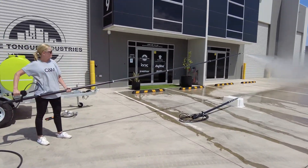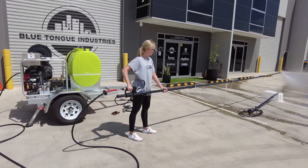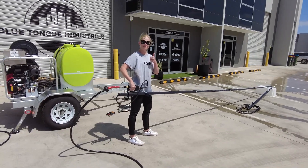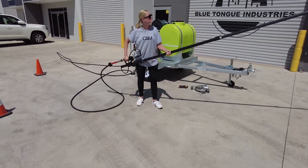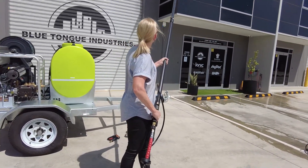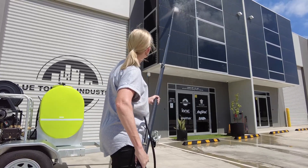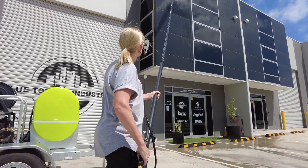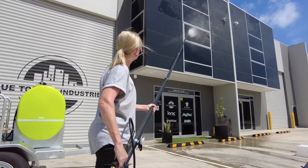As you can see, the ergonomics of such a pole allows easy use — that's 6.8 meters at 24 foot. Easy rinse down, either high-pressure or low-pressure soft wash, reducing the pressure and increasing the flow, staying back from the area. Good flow, good rinse.